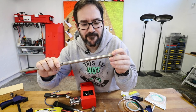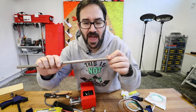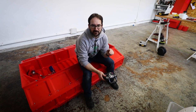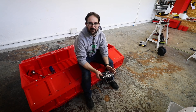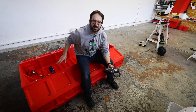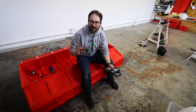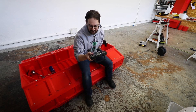Let me do a quick disassembly and show you. There is your problem. The shear strength of the motor plus the reduction broke the bolt — the shear force. Those were M4 bolts, so I will re-drill everything to M5 and we will try again. I've switched all the bolts to M5; everything is now more robust and I've increased the current to the motors. The ESCs I'm using are for sensored motors but these motors are sensorless — I have a solution for that in an upcoming video, but let's do one more test.